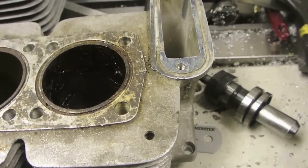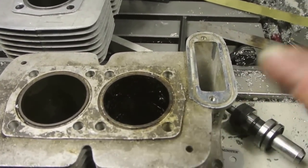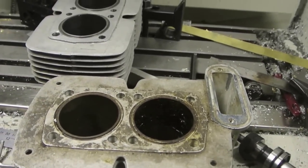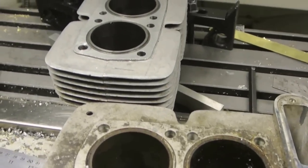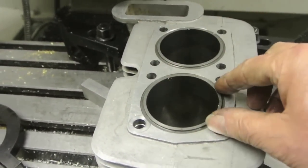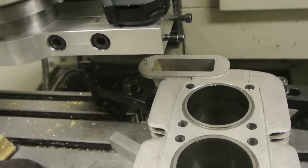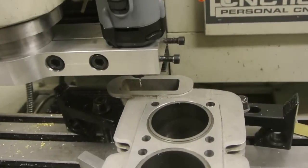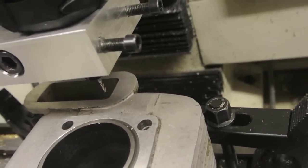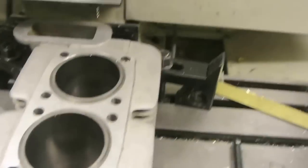What we've got tonight on the machine is the original cylinder for the BSA Fury engine. As you can see, it has this ring groove around it. Part of the problem with this engine is it's been part machined — I've had to bore the casting, fit the liners, clean up one or two bits and pieces, but I've got to do this groove now. I've never used a crest spindle in anger — well, once, just after I finished making it — and I'm letting it cut some air so I can see what it's going to be like when it's finished.